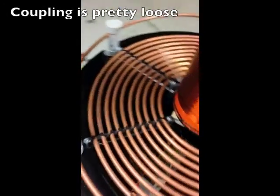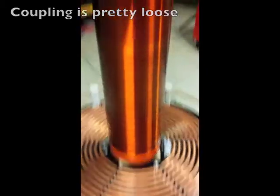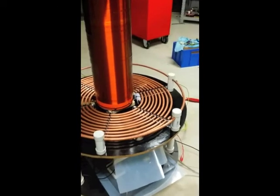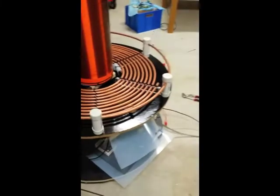It's all going well. 0.05 microfarads there. I've got the tap all the way out, which has worked out well. I was kind of concerned about my primary only having 10 turns, but it looks like it's actually going to be a good match. When I make a final toroid, it'll tune quite nicely all the way out. So that'll be good. Getting some decent sparks.